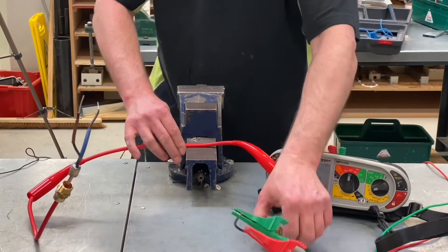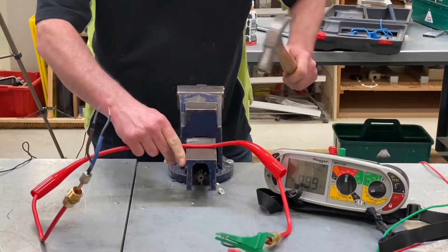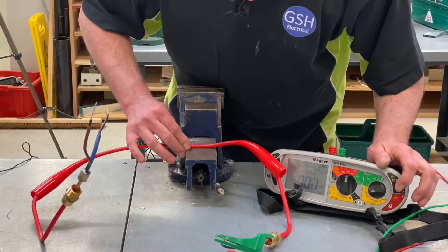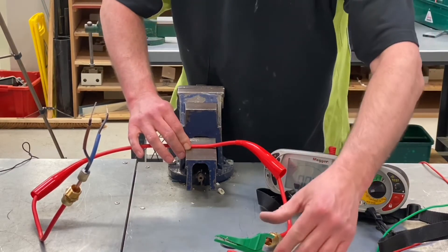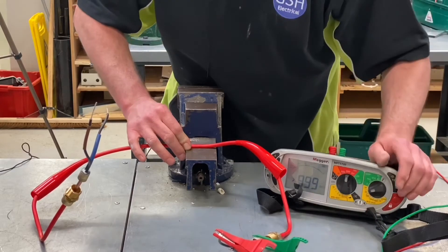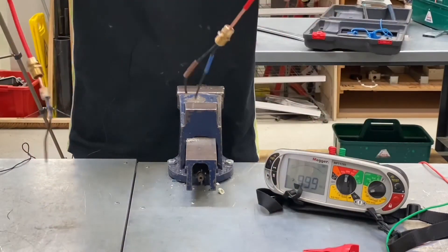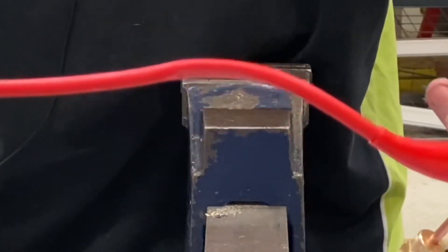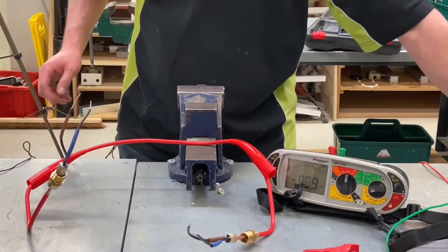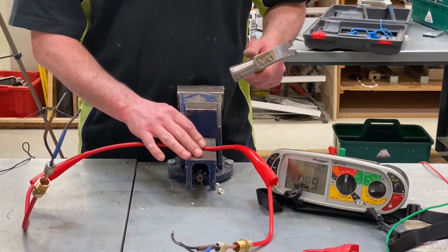I whack it again and move to a slightly different area. After a sustained series of blows, we get a dead short between the conductors — the cable has failed. But proving a short to earth, it's only shorted between the conductors, not to earth. Look at how flat we had to get it in order for the cable to actually fail — hitting it onto a metal surface with a blunt hammer object, it's almost dead flat. We were at stage three or four of hitting it before we caused that breakdown.